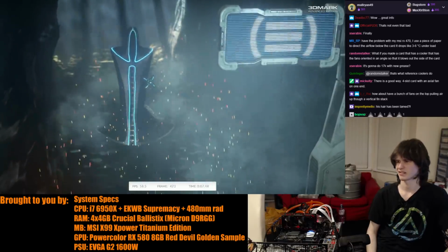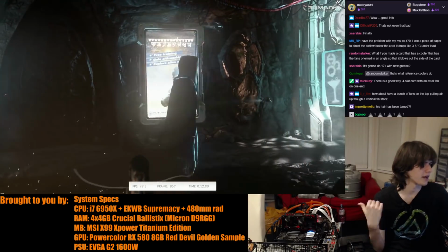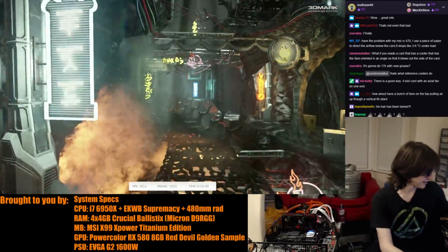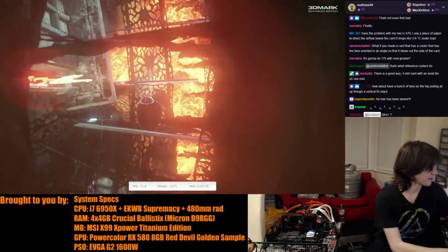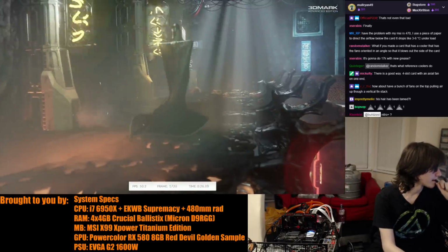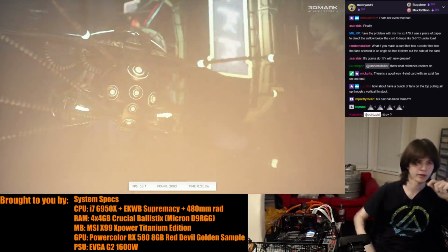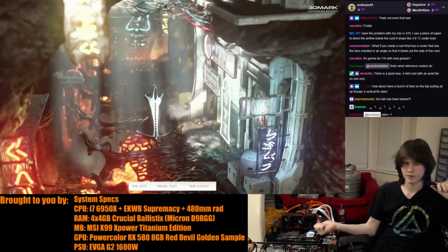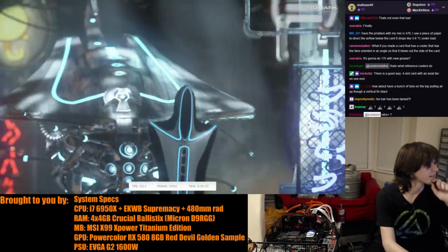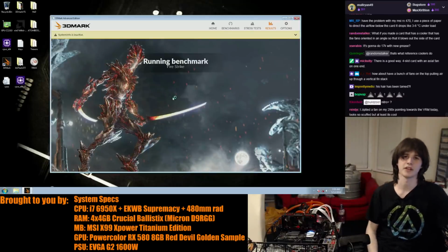I think that might be it. I think everybody else is doing it this way, and I don't like this way. Let's see, 580, because I know there's that Gigabyte card. Okay, no, the Gigabyte card also exhausts over the top edge and down the bottom edge. Though, if you have an M.2 SSD under a card like that, it'll obviously cook the M.2. There's trade-offs to everything, but ultimately, if you do get that airflow in front of the card, those cards tend to run the coolest.